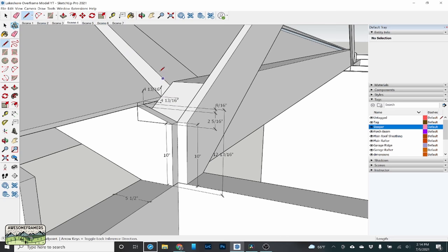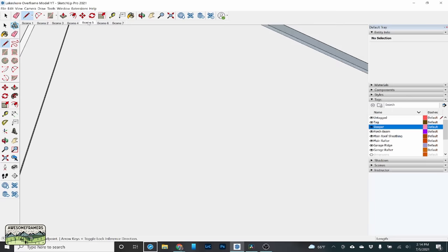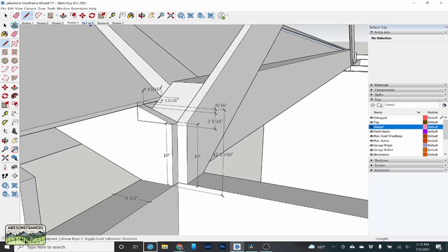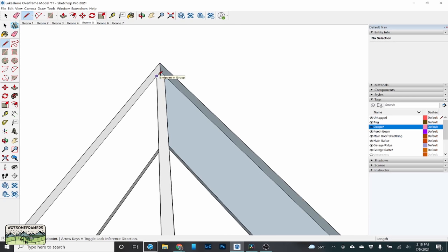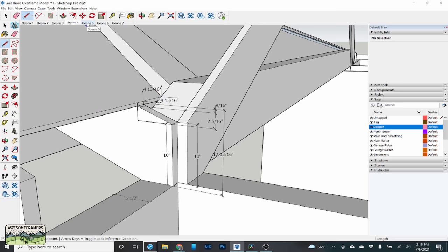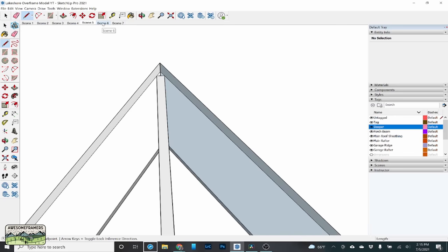With a beveled sleeper, I don't have to make any adjustments at the top — this sharp edge is where everything planes. This line at the sharp corresponds to right at the top of the roof sheeting. It goes along the roof sheathing and comes to a point, so no adjustments needed. Once I calculate the length of the sleeper, it's sharp to sharp — miter to sharp, bevel to sharp. We always read it off as sharp sharp sharp to sharp — it's just kind of a dumb thing we do.